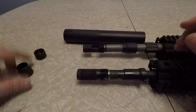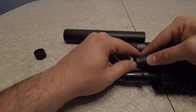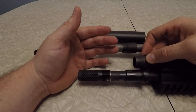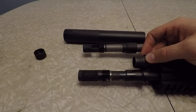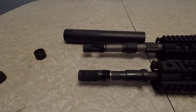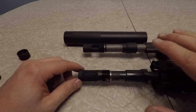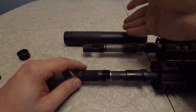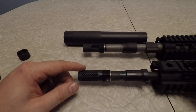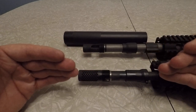If I were to run the M4 collar on this, I couldn't use it because I actually couldn't step it back far enough the way this was set up. I would actually have to turn that collar back so that it sits in the M203 cut — it would just be weird. I decided I didn't want to do that to make it work with this setup, so I used the reflex collar so he didn't have to machine back that much. That's just a brief rundown of some of my lessons learned running this can and actually using a mishmash of parts that Allen Engineering never intended to be used. He wants you to use the proper M4 can with the M4 collar and the M4 barrel. Allen also does not recommend using Spikes Tactical parts.